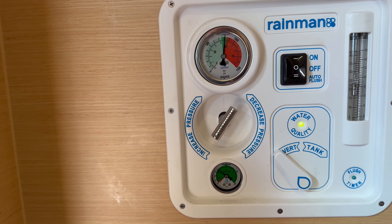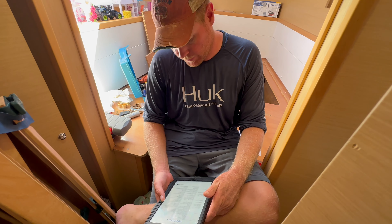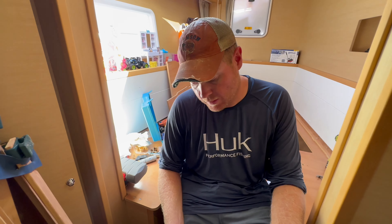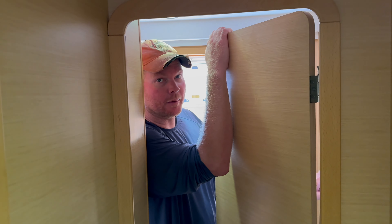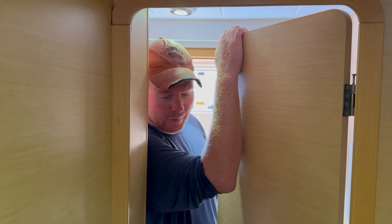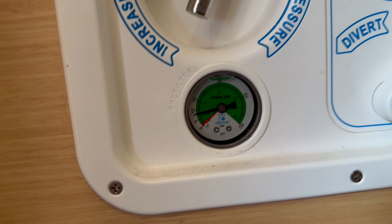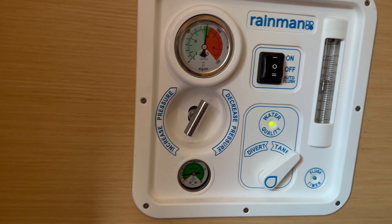How's it looking? I'm just making water — everything's looking good. Why do you say that? What's wrong? It's only putting out like 23 gallons per hour. The high pressure hose is vibrating. The pre-filter pressure's jumping just like it was before. I ran it down and back up a few times — maybe it's just working the air out. It's not vibrating as much now, sounds a lot smoother, the pre-filter pressure is steady. It's putting out about 28 now — a lot better. I'm a lot more happy now.